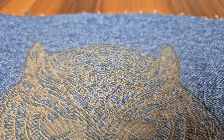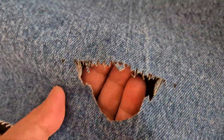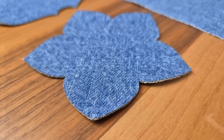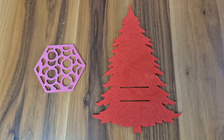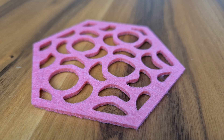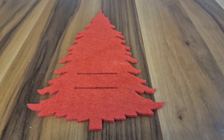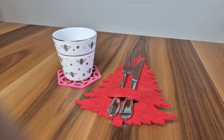However, when the jeans are chemically washed in special machines, these areas become white and the patterns can then appear much more clearly. At first when I was trying to create the pattern I forgot to lower the power of the laser — I saw it cuts the fabric well, so I tried cutting it in two pieces. It did it beautifully too; it was able to cut denim quickly and cleanly. I tried cutting on felt as well. Felt is a material that burns quickly in diode laser cutting, but for a fast, high-speed device with air support such as the Snapmaker, such materials are not a problem at all. Both materials I worked on cut cleanly and precisely.